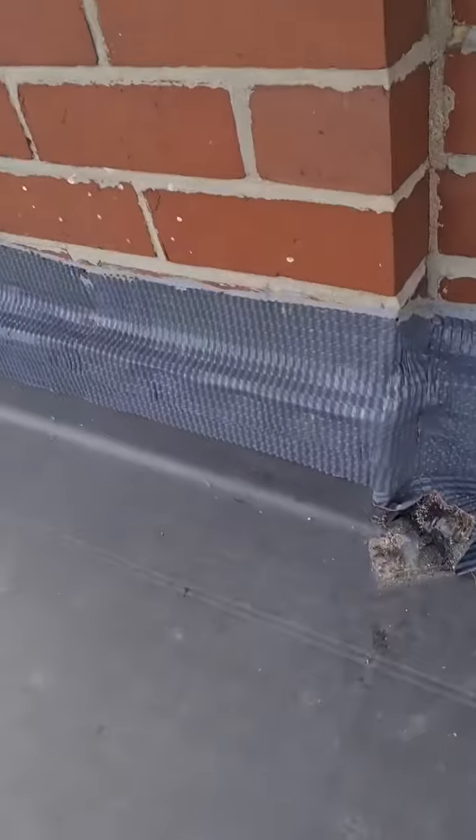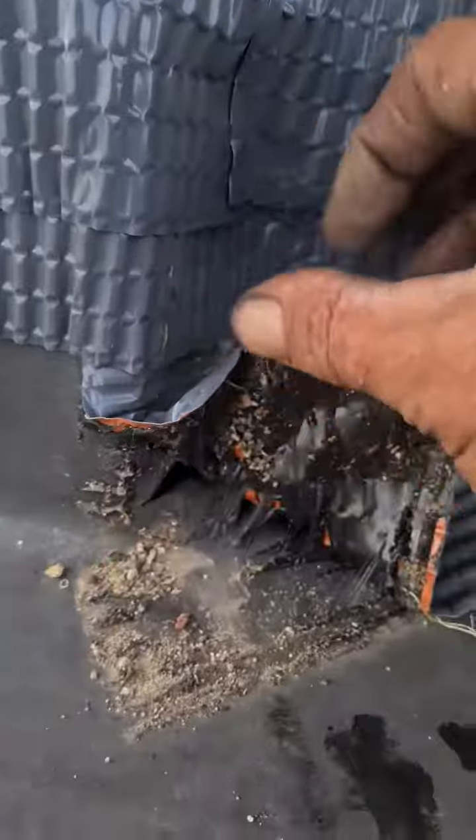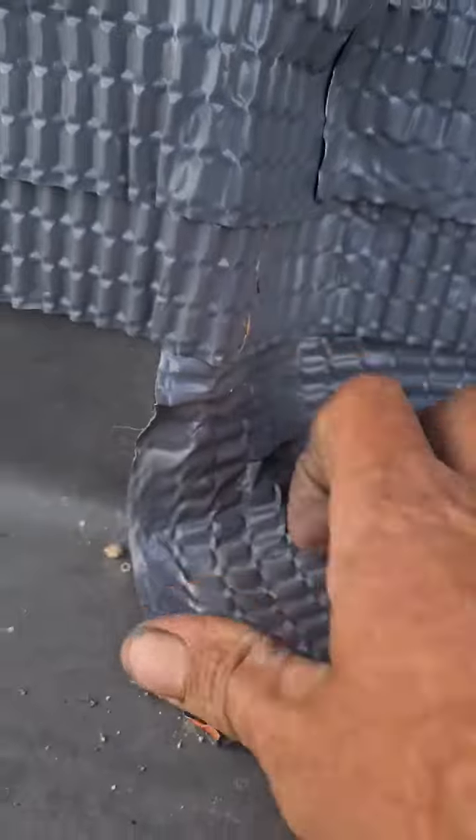Assuming this is the bit you're seeing on the drone. What I can't tell you here — the roof deck is not glued down. Same again here. This isn't the correct product to use on a rubber roof. The two chemicals react. Into the inside there. Absolutely not good at all.